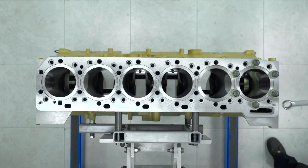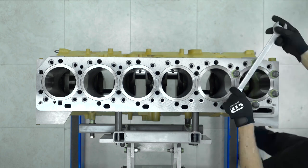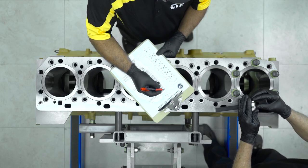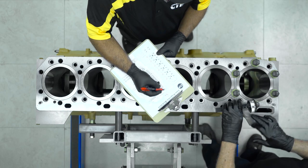The technicians install six special hold-down bolts and washers on the first liner being tested. These bolts will hold down the liner and the block plate securely so that the liner projection can be accurately checked.